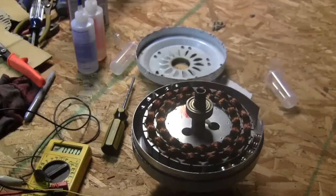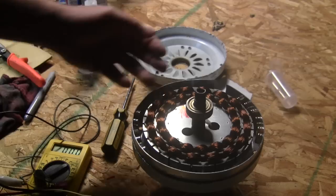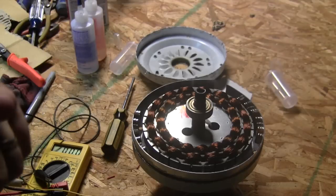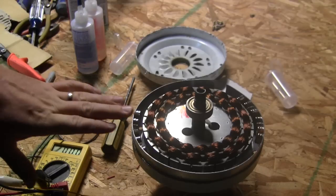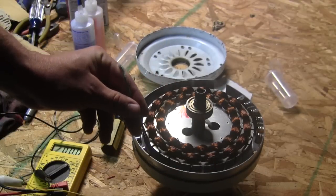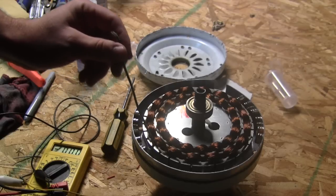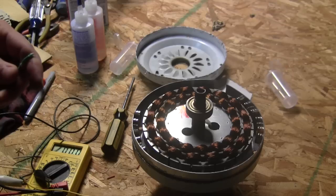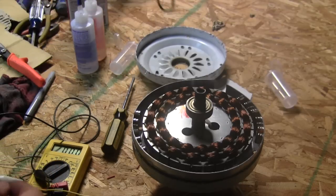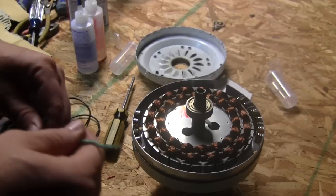I've got what I have in here — I think five sets over here and six over here on this side, so quite a bit more to fill up. Magnets are not cheap, so I'll buy more before the next segment so you can see it completed. You can just take some heavy gauge wire with a little loop and move these things around. When these repel they like to move apart a little too far, so you can glue some of these in place first so that when you go to put the next magnet beside them they won't move. There is definitely a trick to it.